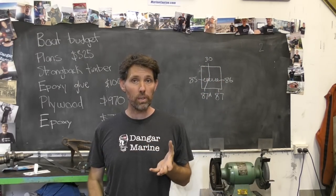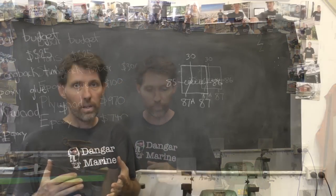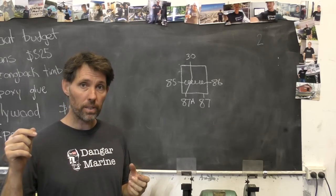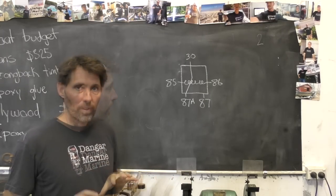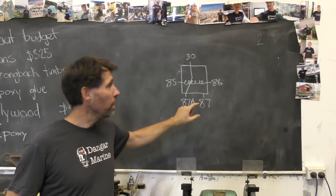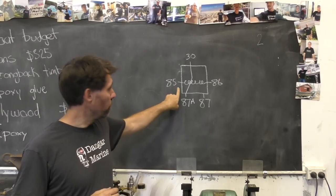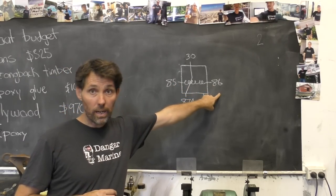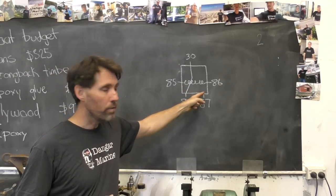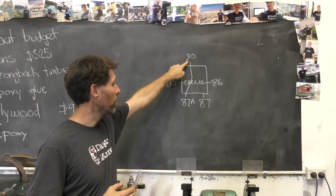Before we get started, we'll just do a little bit of theory on relays. I know we've sort of covered this ground before, so we'll go through it really quickly. Relays are nothing more than a switch that you activate by passing current through them rather than pressing them with your finger. The things we want to power get connected to pins 87 and 87A, and the power for those things comes into pin 30. When we pass power through the coil between pins 85 and 86, they form an electromagnet which pulls this little switch over, and then the power goes from 30 to 87 instead of from 30 to 87A.